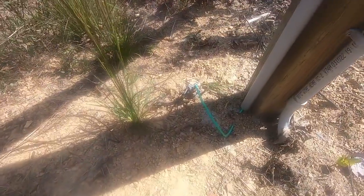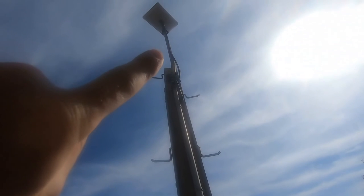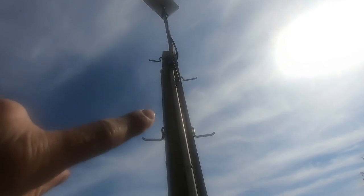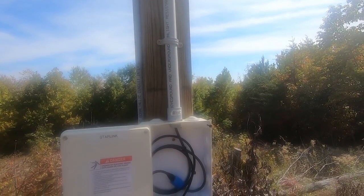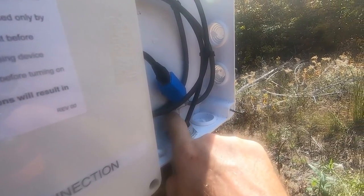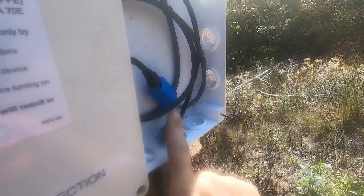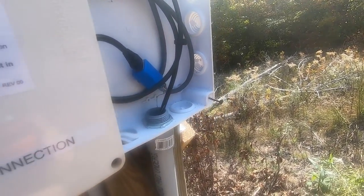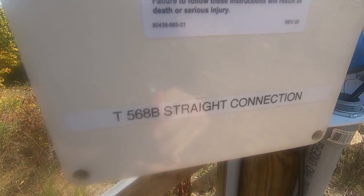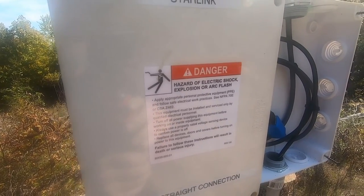There's the grounding rod that I was talking about — it goes up this conduit and keeps going, and I have it connected to the satellite dish metal. That's it; no more, don't go nuts — that's just for lightning. Then I've got a one-inch weather head coming down to the junction box. This is what I want to show you: see this drain wire? I left this as an example — it's going back up to the cabin. It is NOT connected at this ground rod. Remember, I was talking about the drain wire — it has to be going back. I can't stress that enough. And this is the connection that you need — hit pause, go look it up.